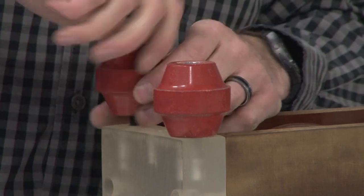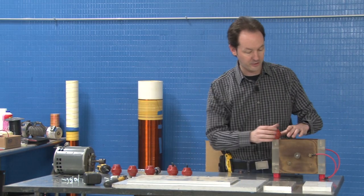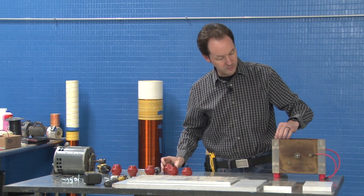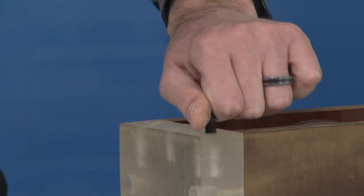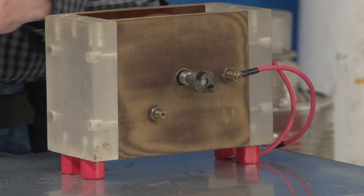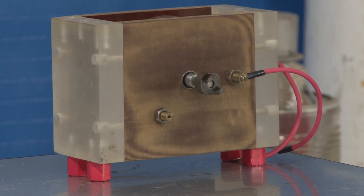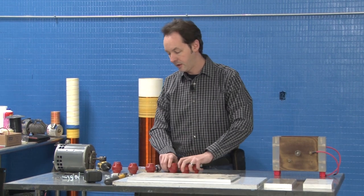This is a relatively classic synchronous rotary spark gap design. It's a little bit different in that Mr. Coppersmith did a couple of interesting things. He had an extra set of electrodes off phase to double the break rate and things like that. We have experimented with that, but for such a small coil, we don't really need it.